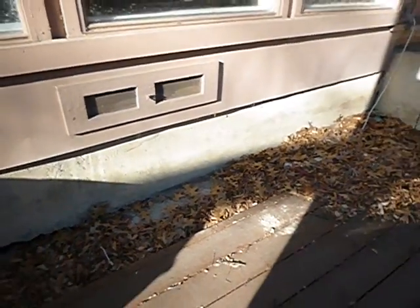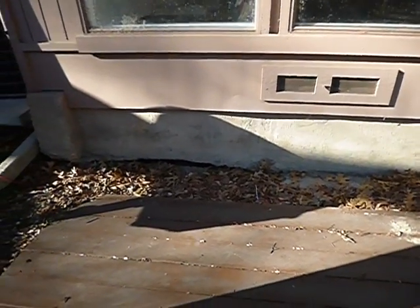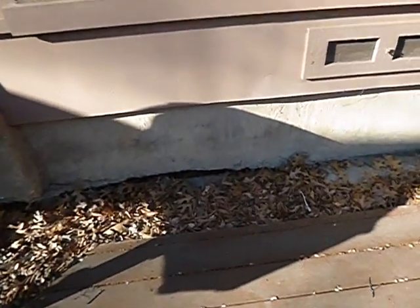The deck here is going down — we've got negative drainage going to the house, to this crawl space area which I cannot get into. Since I couldn't get in there, I didn't see anything. But we've got negative drainage and erosion right in there.